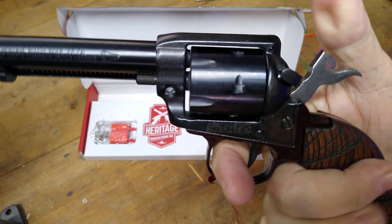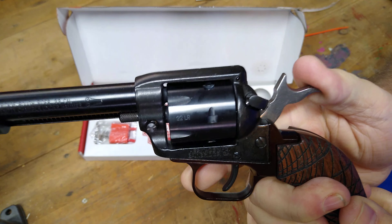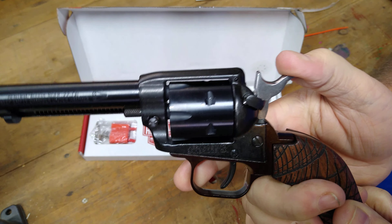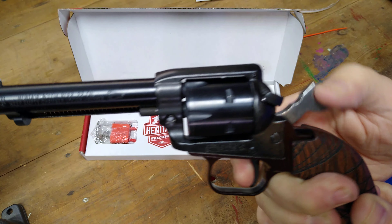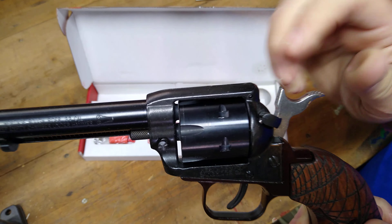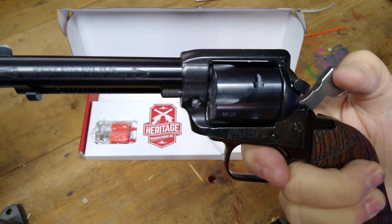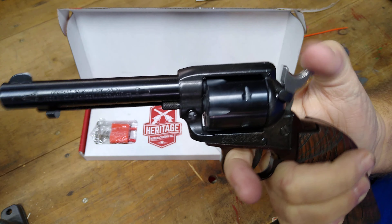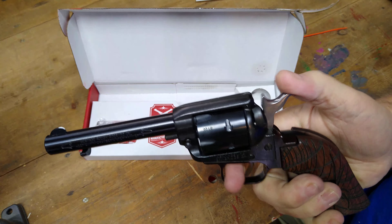I don't think that hammer spring was the issue. I think this cylinder has far too much forward play. You can see there's even a drag line worn around the front here — you typically see your drag line there, but why it would have a drag line there on the front I have no idea. It just doesn't seem right — it's clunky as hell. It actually feels worse now than when I sent it.